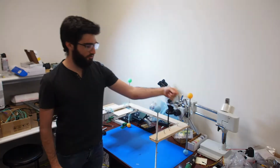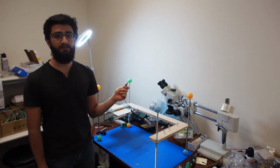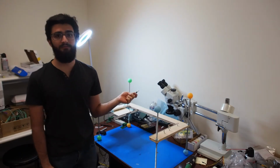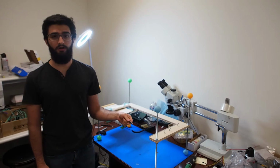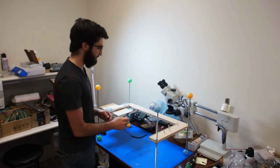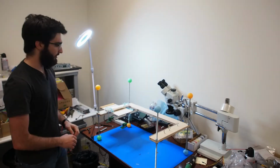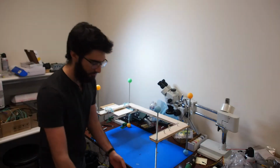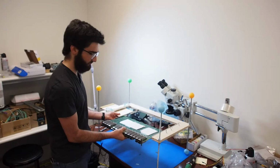The assembly fixture has an ESD strap that will neutralize any static discharge that begins to build up on the fixture, and this eliminates the danger of any harmful static discharges onto the card that could potentially damage the electronics. So this needs to be plugged in. It's important to also wear an ESD strap yourself, and from here we can now insert the card into the sled.